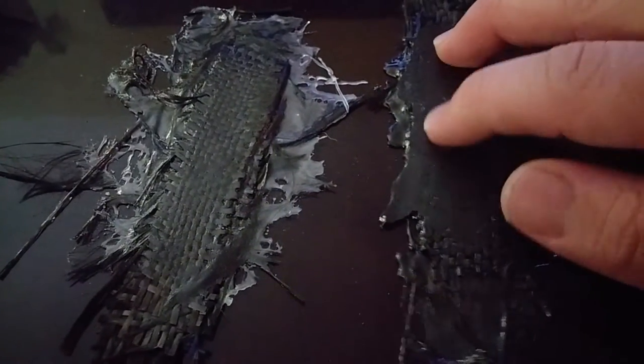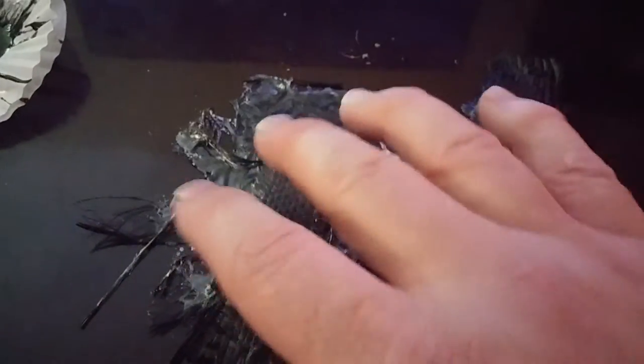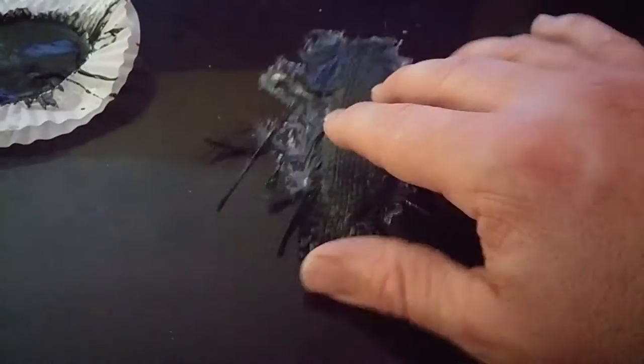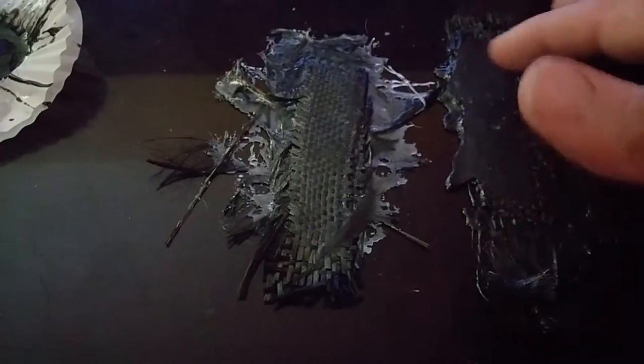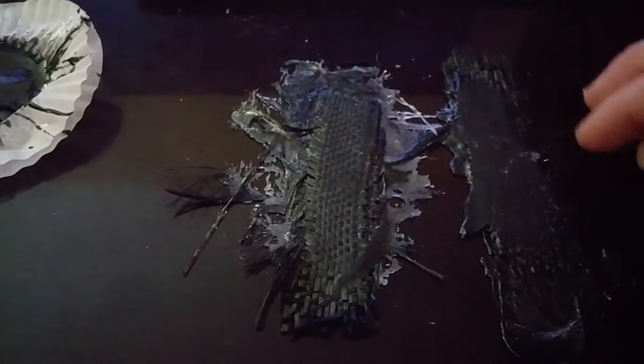It's what's right here that matters. And if you notice, this looks smooth already. Why? Because it wetted out and made a layer over it much easier. I pressed both of them so they both used about the same amount of resin — actually this one used a little less ironically, and this kind of squished out a little bit. But it wets out easier. You can put less resin and wet out the carbon fiber, and it's ready to go. That's the key to making better laminates, but they ended up still being roughly the same thickness.